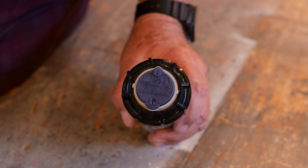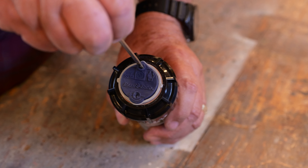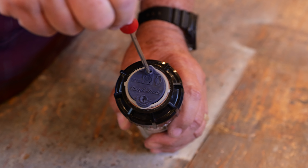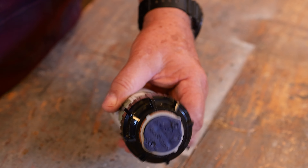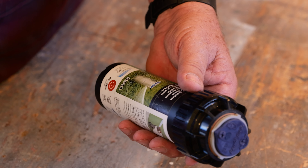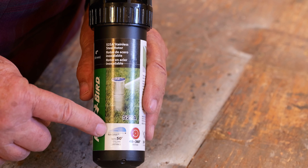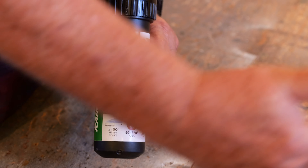If it's projecting too far or too little, the screwdriver goes right down through there. Once engaged, you can tighten it down to shatter the stream a bit and shorten the throw, or back it up to create more of a solid stream. Rainbird has what they call Rain Curtain technology, which creates a decay of the water stream so you get a curtain of water going along the underside of the arc.